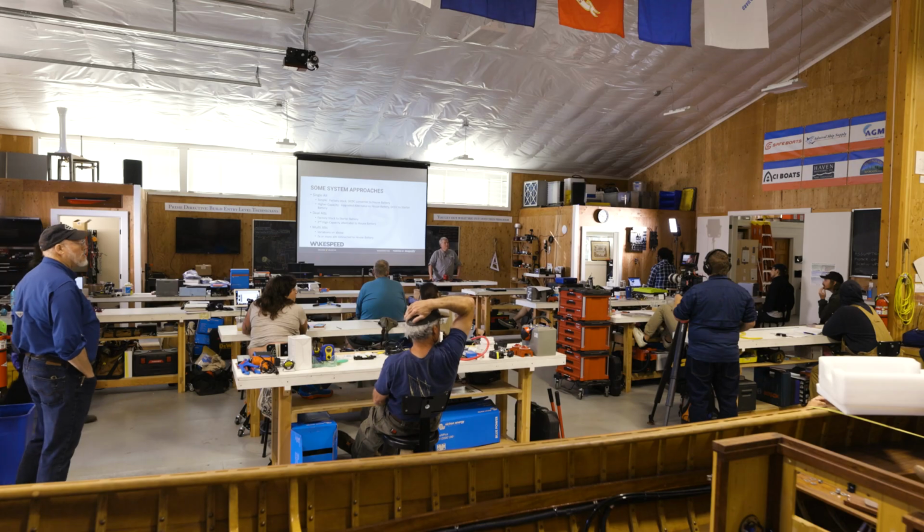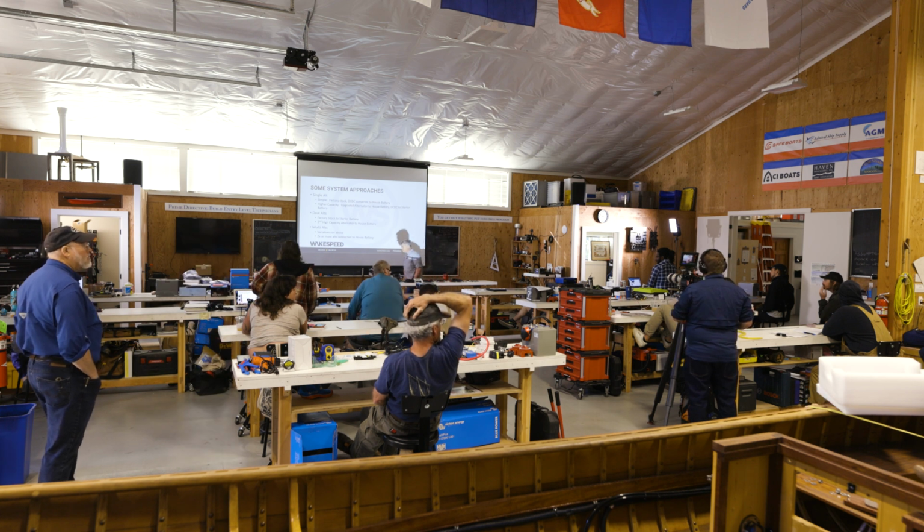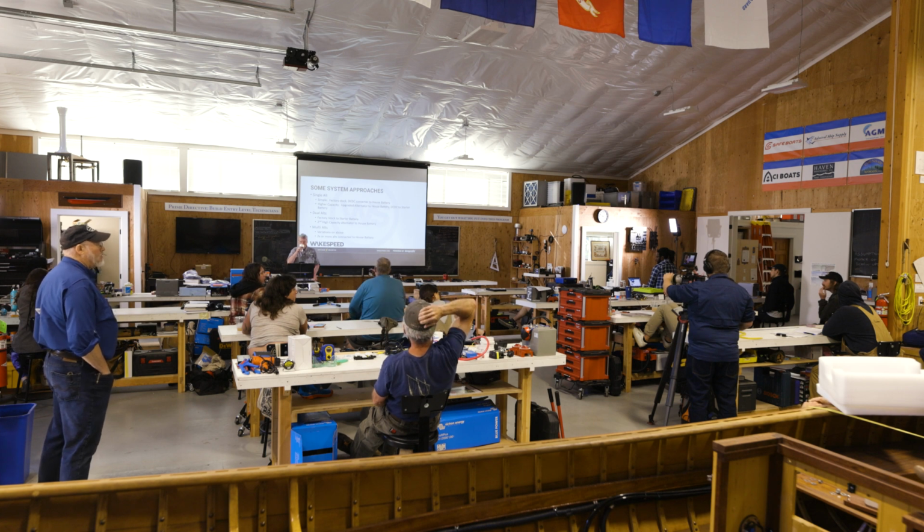Yes, sir? If you're doing 200 to 300 amp hours, if you've got a couple of group 31s for your house bank, you've got a 60 amp alternator on the engine, that's a perfect solution. Just throw in an Orion and you're good to go.